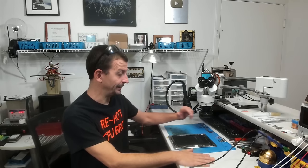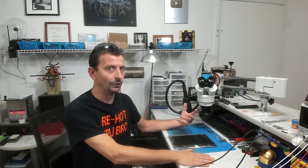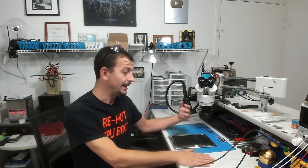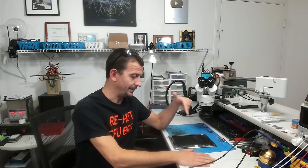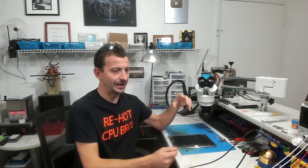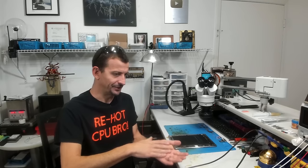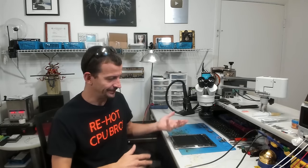It's a repair shop. They get the iPad back, and it's got the classic fault where it only charges whenever it's powered off, and it also automatically turns itself on. So with a dead battery, what that means is that you can't wait for it to boot and then turn it off and then let it charge, because as soon as you do that, this iPad turns itself right back on, and when it comes up, it won't charge. The battery's dead. It shuts off because the battery's dead, and then it charges just enough and turns back on and then shuts off and turns back on.